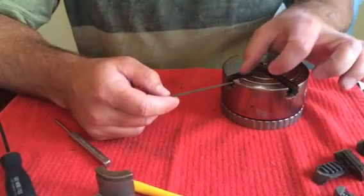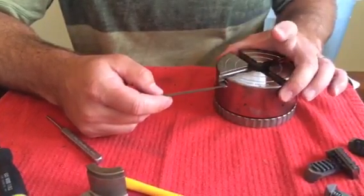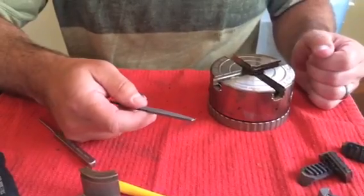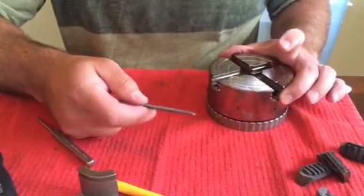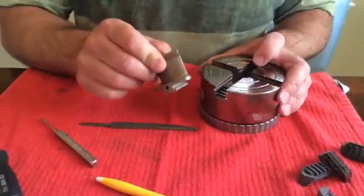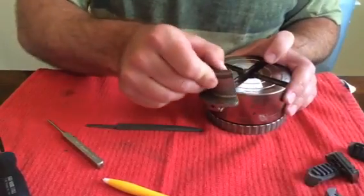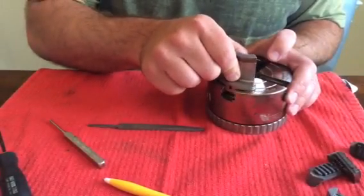You're not going to hurt it, but there may be a little bump from nickel plating that you need to get rid of. The main deal is our older chuck bodies and our newer chuck jaws — as we tighten up our manufacturing tolerances and get better and better at making Easy Chucks, the newer jaws sometimes are a little snug in the older chucks.